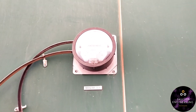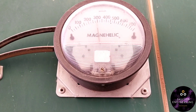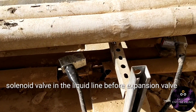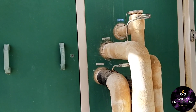On the right side and left side, there is a gauge with a range indicator. If the reading is about 400, you need to replace or clean the filter. This one is the pressure and temperature sensor. In the liquid line, you can see the solenoid valve and solenoid coil, located before the thermostatic expansion valve.